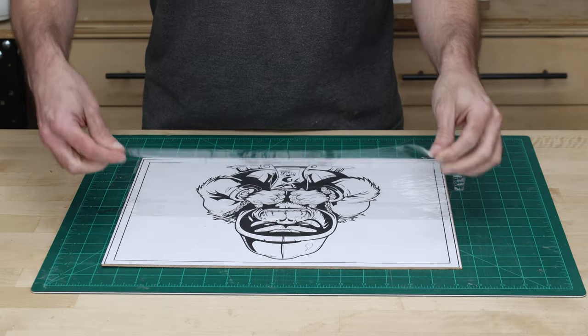As far as the blade goes, I'm gonna use a number five crown tooth blade. I'll drill a pilot hole and then start cutting out my shape. My goal is to cut on the outside of the black line — that's going to be the shadow — so when I start cutting pieces to make my artwork, I'll have that solid line, that space between the background and my workpiece. Cutting out the outside shape isn't too bad; there are a couple jagged areas where you make a cut, back off, make another cut, then there are other parts that are just swooping curves. I'll try to keep as much of the gorilla intact as possible — I might need some pieces later for alignment.